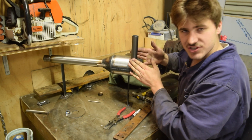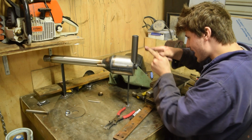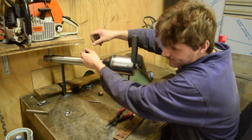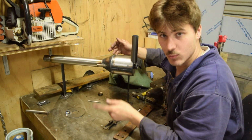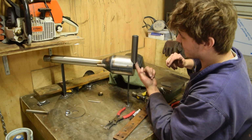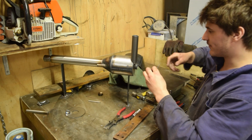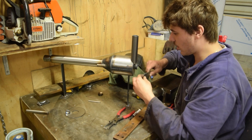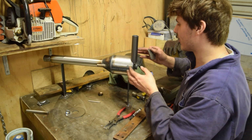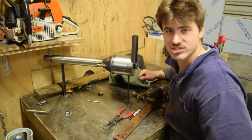Now what we're doing is the water inlet. So we'll have the water coming in here, spinning around, and then jetting through the fins all the way down and straight out with sound effects. Now, obviously you can possibly see a minor issue. We have half the water not making its way in, so let's get this bit of flat plate, turn it into a cone, and gently guide and persuade the water around and have some beautiful hydrodynamics. Or just beautiful water flow.